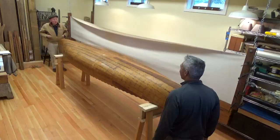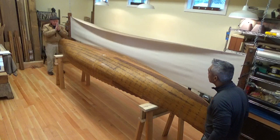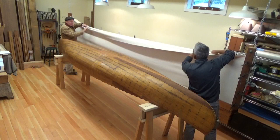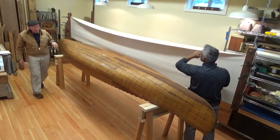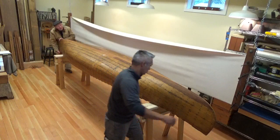The tension you want gives a little thump, a little bit like a drum. Now, as this has stretched out a few days, I don't mean to leave it in this position too long — I'm just going to go right to the next step, which is putting the canoe inside. So we're going to put this in the canvas. As we move this into the canvas, there's a center line on the canvas and we want to make sure that the canoe lays right along that center line instead of being sideways one way or the other, looking for any straight threads that might help guide us.